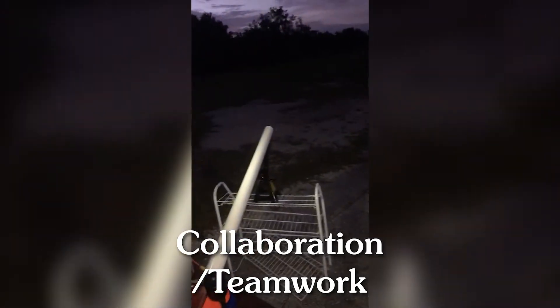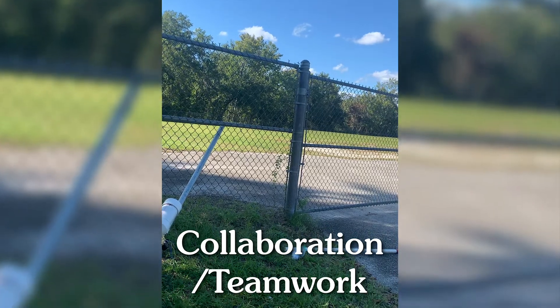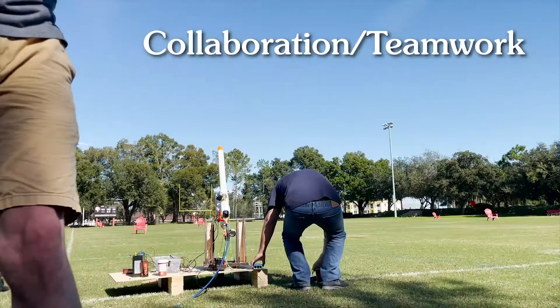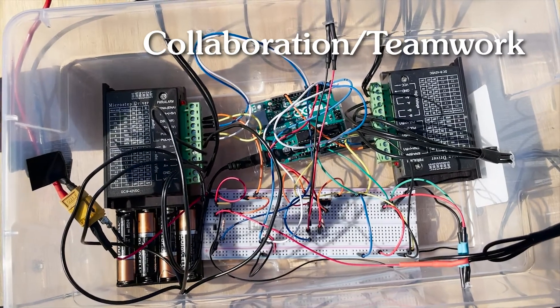I'm Frank St. John. I worked on system design and CAD development for this project. I'm going to explain how our group was able to creatively collaborate and achieve successful teamwork. We originally drafted a design that would launch a projectile by forcing a golf ball between two rotating wheels, much like a baseball pitching machine, causing the ball to inherit its angular velocity. Once issues arose, a few team members split off to prototype a pneumatic design, and eventually the team made a full transition, splitting into two groups: one to work on power and controls, and the other for design and hardware assembly.